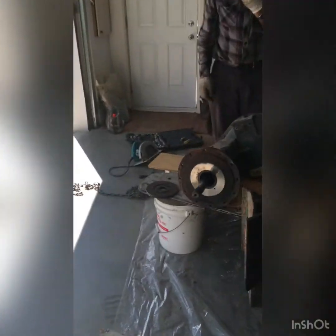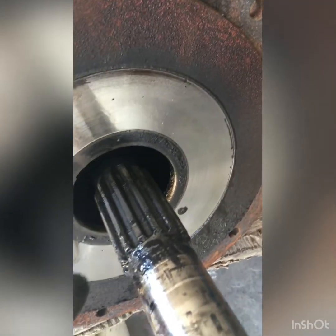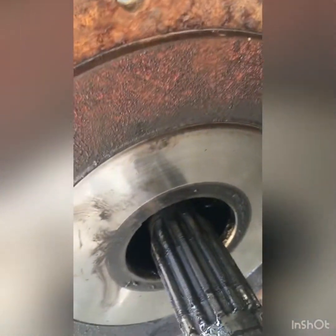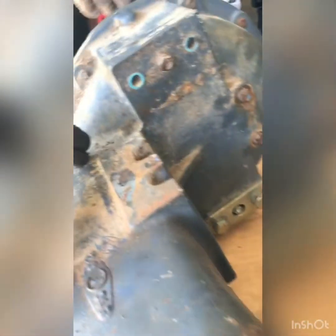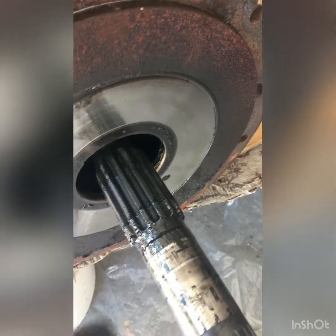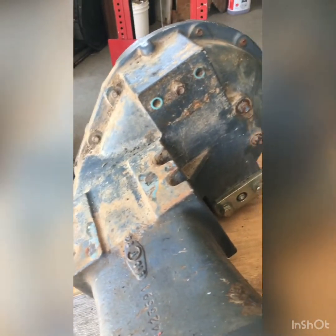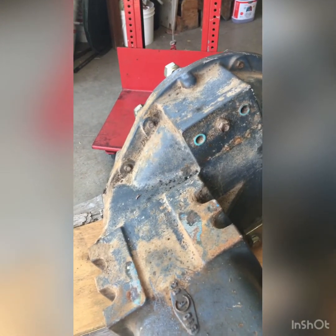Here, as you can see, it's totally greasy, and inside there's about 1 inch of oil in the bottom of this portion. It looked like the seal right here is no longer good. The seal that seals the shaft, you see the mark right here. The other seal inside the transmission is working well, but on this side it seems to leak. So we will have to disassemble this to replace it.